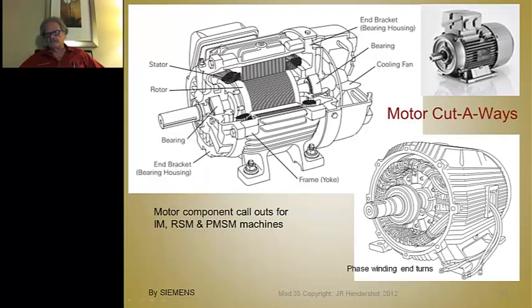The details of lead egress and junction boxes are very important — they take up a lot of space internally and are thermally not very good. That's why lead wires are always a heavier gauge than the magnet wire: whatever current density you have in the magnet wire, you want lower in the lead wires, because these lead wires are not touching any metallic thing that can sink heat out of them.